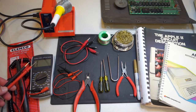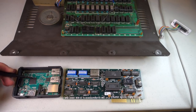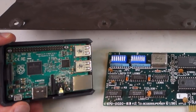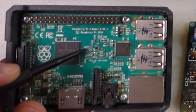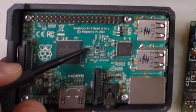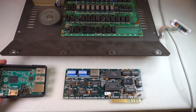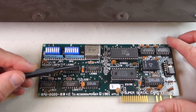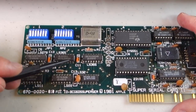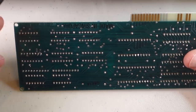There are two types of ways circuits are mounted onto a circuit board. The modern technique uses surface mount components, meaning all the little components like resistors and chips are mounted directly on top of the circuit board and soldered to little pads on the surface. This makes it easy for modern machines to assemble by automatically placing and soldering components. Contrast that to older computers which typically use through-hole soldering, where chips, resistors, and capacitors mount through holes called vias and go directly through the board to the other side. These are considerably easier to work on, though they take up more room.